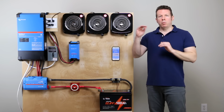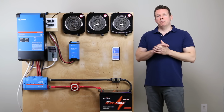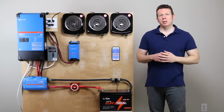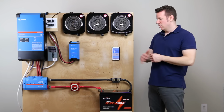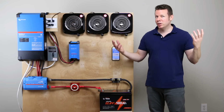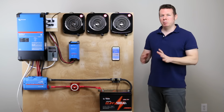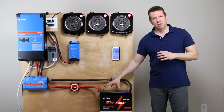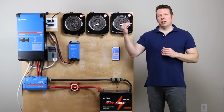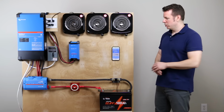And it's a little bit more expensive than their basic 100 amp hour lithium battery. But to me, that's what every battery should have. Even if you're in a mild winter climate like I am here in Houston, Texas, you still want that low temperature charging shutdown because you may travel somewhere really cold, turn on your charger accidentally and damage your battery. So to me, we've already got that battery management system in the top of the battery. You might as well have that low temperature shutdown that frankly all the more expensive batteries already have. So that's the trolling motor battery.